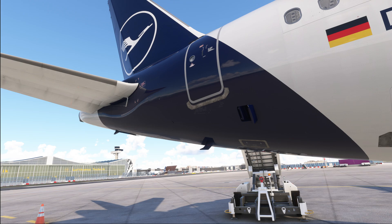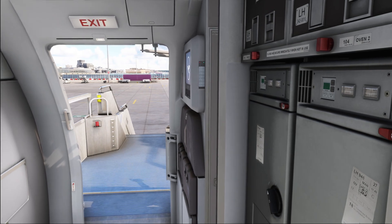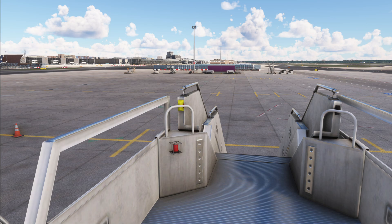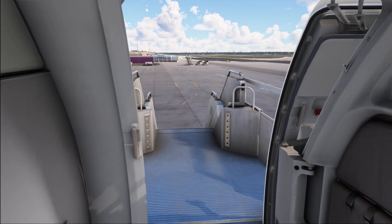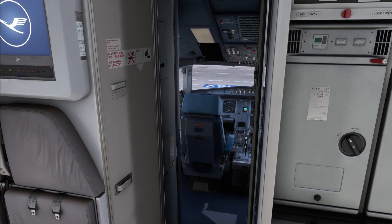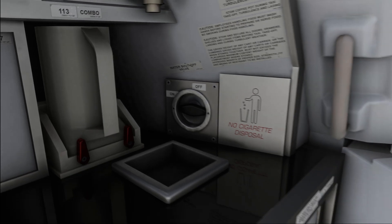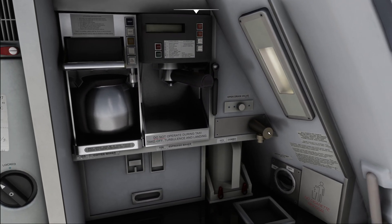Last but not least, something not so important for simulated operation but very important for real world operation: the manual shutoff valves. More often than you'd like, your water systems are going to run over — either the sinks or the toilets. That stuff happens on Airbuses, believe me. When you're running into problems like that, there is a manual shutoff valve located below the sinks in the cabins, and also one in the lavatories. Over here we've got the water shutoff valve — if you flick that one, all water is going to be shut off to that galley. If the water ever keeps running, that's what you want to do.